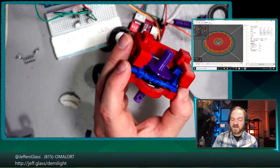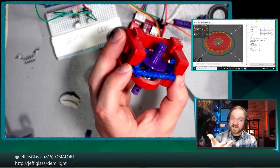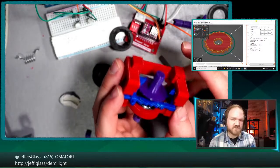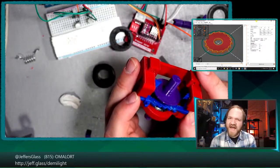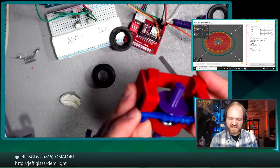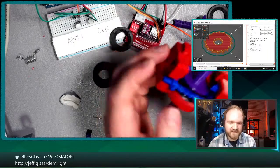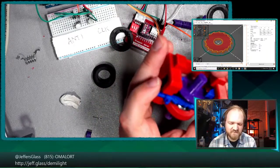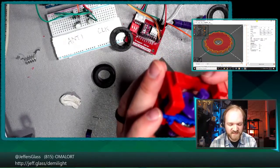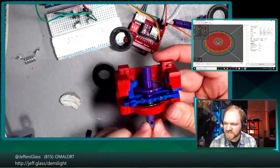We also have a bunch of DC solid state relays, right? So that's ultimately what I ended up using. But there's also this whole class of back-to-back dual MOSFET AC and DC switchable relays, which I'm still not 100% clear on how that works. But yeah, long story short, don't use a triac to switch DC, I guess is the point of the thing. It's a little bit wobbly now, which I don't love.